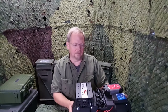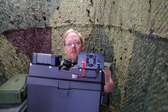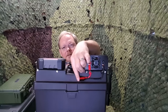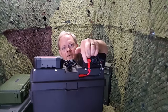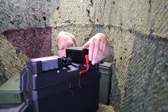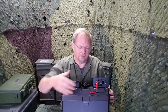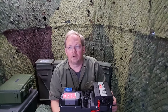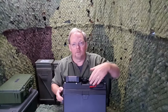The next thing we have is a 12 volt output. Going back to the back again, we've got an Anderson PowerPole connector here, and this is the heavy gauge wire that leads up to the inputs on the inverter. Behind it, there's another wire that goes down and inside, and this connects directly on the battery. So we've got high current capabilities, and I've used this successfully on my 100 watt ICOM 7200 HF rig without any problems at all.